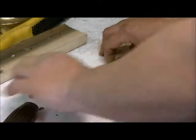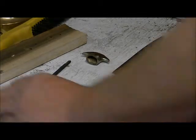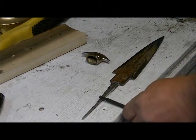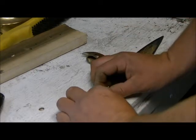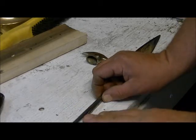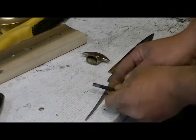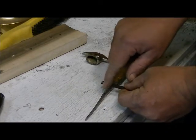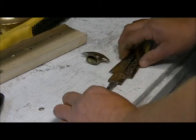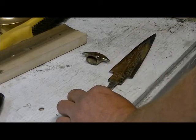So we got this taken apart. I already did some things ahead of time, just to pre-prep. So what we're going to do is cut a chunk of this tang off till we're about the same width as this replacement piece, which is actually quarter-inch threaded rod, and I've ground down the top here and the bottom. So we're going to cut it off about here, roughly, okay?